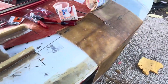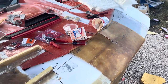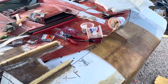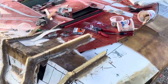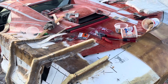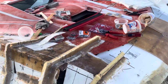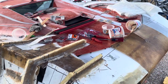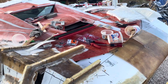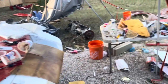Down in the description I show you the link to the calculators I used to determine how much gel coat, how much fiberglass resin, and how much fiberglass mat to use. It has a drop-down so you can pick whatever material you're using for the fiberglass — it even has carbon fiber. You have to get good at converting between cups and pounds, teaspoons and ounces, and all of that stuff. I gave a little cheat sheet down at the bottom of what I use and what works for me.